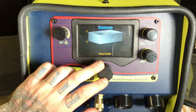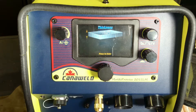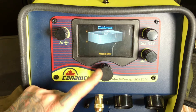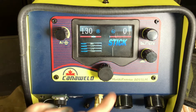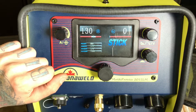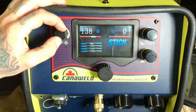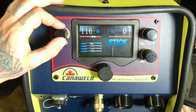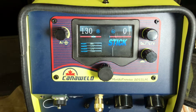Now, what kind of thickness are we going to be working with? You just adjust the dial here. You can see it displayed in millimeters — you can also have this displayed in inches if you prefer, and we'll show you how to switch that over later. So let's pick some quarter inch. Now we get the final rundown of the parameters we've selected: stick welding mode, quarter inch thick plate, 1/8 diameter welding rod, 70-series, and the machine has us set to 130 amps. We can go up 20 to 150, or drop down to 110, depending on how you like to weld — some of us move a little faster, some a little slower. And that's it. You've got yourself set up for stick welding, just like that.